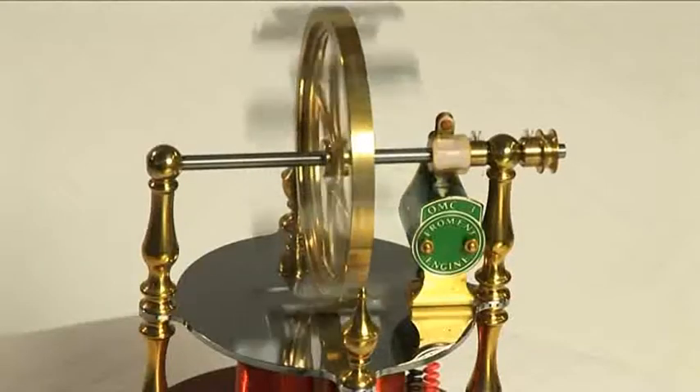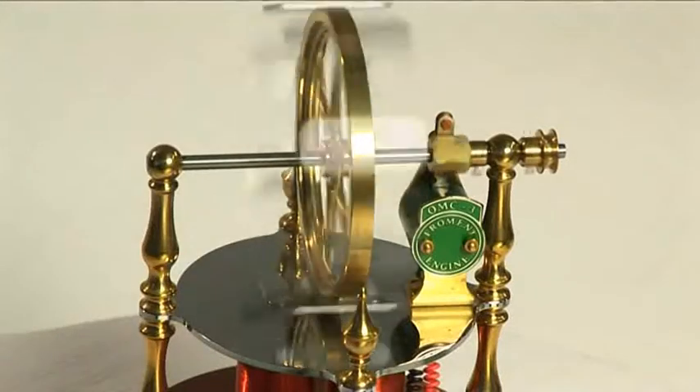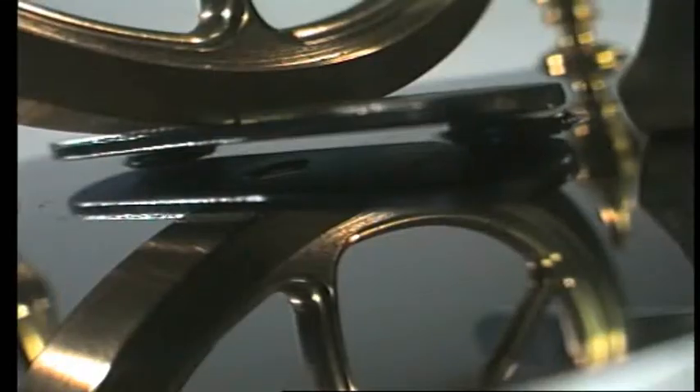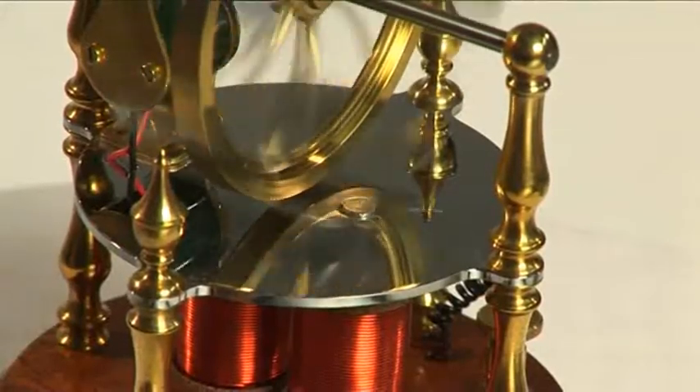In this example, four armature blades are arranged on a flywheel and directly above an electromagnet. As the armature blades approach the magnet, a cam-operated switching system energizes the magnets, pulling the armature around. As the blade becomes level with the magnet, the power is switched off and the flywheel continues to turn, bringing the next blade around and so on.